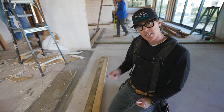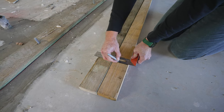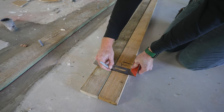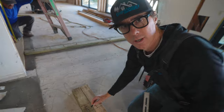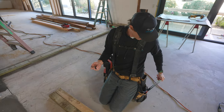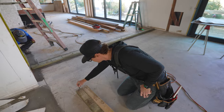This mark represents where the opening ends. I'm using an inch-and-a-half tool to represent what we call a trimmer. The next board next to it is called the king stud. So we've got king stud and trimmer on both sides of the door opening. Now we've got our door opening measured and ready. Everything else in the wall is basically filler or drywall framing. We always need a stud on the very end so we have something to nail to.